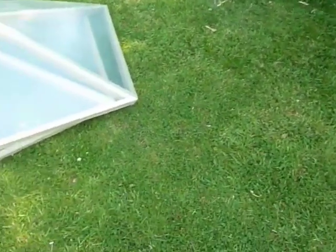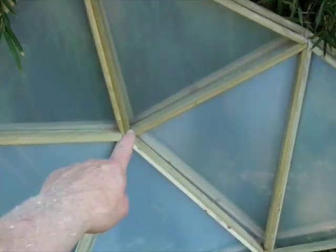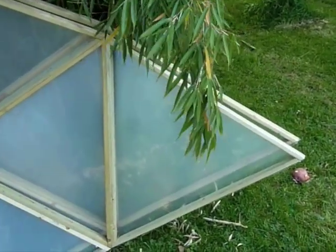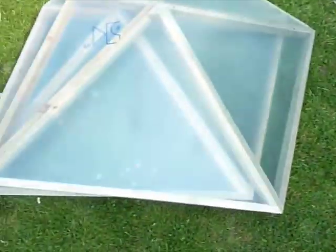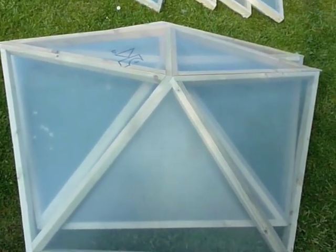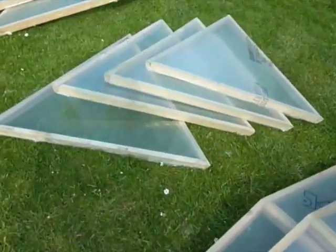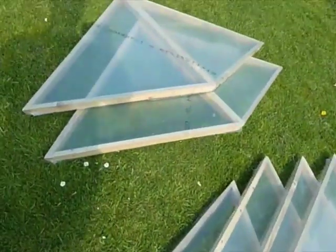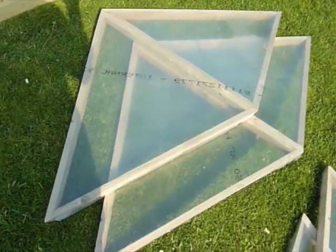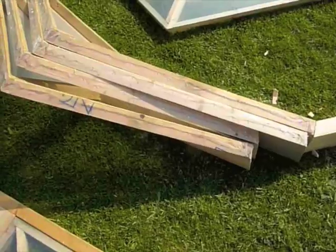We have all the basic panels made now. I'll run you through a list of everything that needs to be made. We have six of these — you can see it's a pentagon. All of those are pentagon triangles, and that one on the end is an equilateral. We need six of those. Next is these, which are the door — these go beside the door. And this is another pentagon, but it's been cut through here to form the door. So that's two standard pentagons cut down. Next we need four equilaterals — that's for a little random space. These are two pentagon triangles, just two triangles joined together — that touches on the base and gets your base started. These are your base ones — we've got four: two left handed, two right handed.